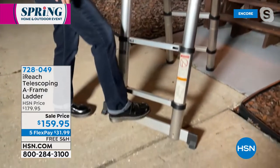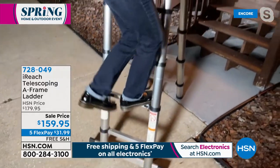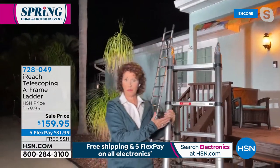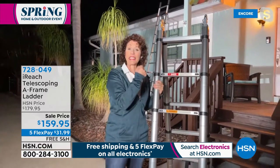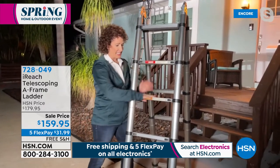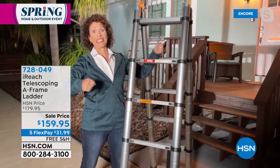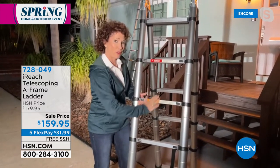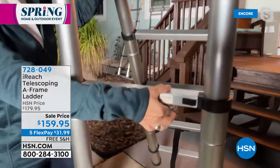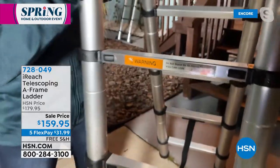For somebody like me — I have been on a lot of ladders, and they have been really not the best ladders in the world. This is what I love about this A-frame ladder because I have that support bar. It's made out of heavy-duty aluminum, but what that does is it makes it nice and light so I can pick it up and carry it. The other thing that's nice: a lot of times those telescoping ladders or extension ladders have that round bar and your foot might slip off. This doesn't — it's actually ridged and it's square and it's flat, so my foot can fit really nicely and it's not going to slip off.